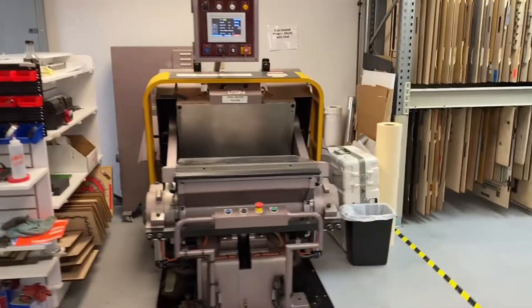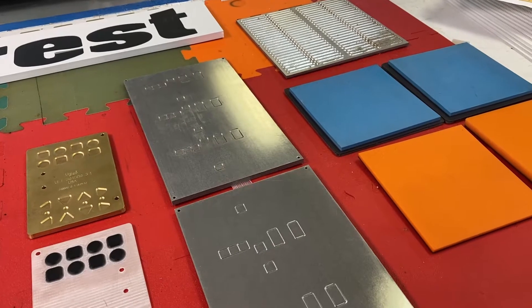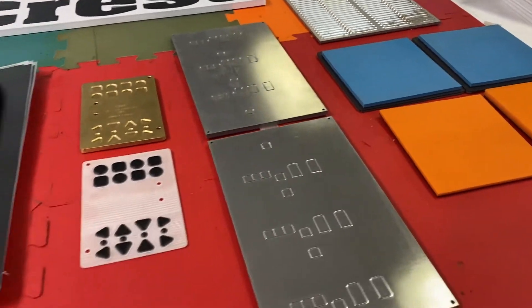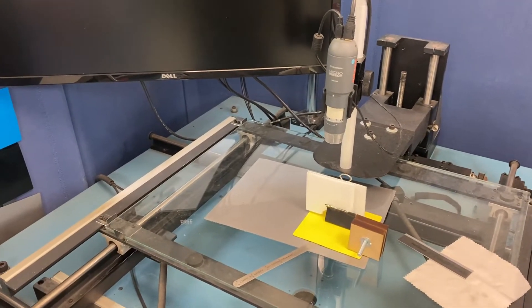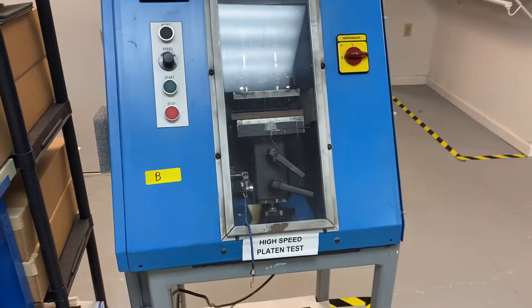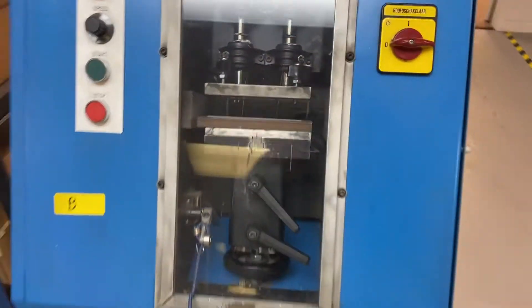Next, you'll see our Crest 2026 embossing press. Our embossing press is unique in that it has a heater on a moving platen and a heater on the head of the press. That reduces ink fracture during the embossing process, reduces dwell time, and improves the quality and consistency of the embossing. We have visual inspection capabilities — essentially an electric microscope — where we can look at the edge of a cutting knife to see how worn or damaged it is and what the tooth profile is. We have a rubber rebound test for testing force, and a high-speed platen test where we can test things like urethane cutting pads. We can put the knife and pad in there and set it up for five, ten, or fifty thousand hits.